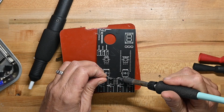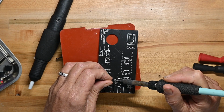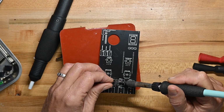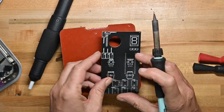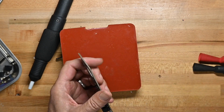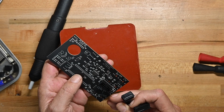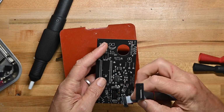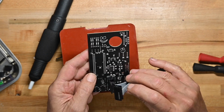The power connector is a keyed type, which is good, and the circuit board has a good silkscreen outline of the connector, and we'll just verify that, even though I'm verifying it after I put it on. But the red stripe should be down this way, and with the key set the right way, it is, so that's good.